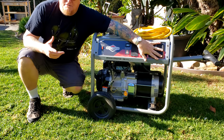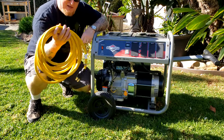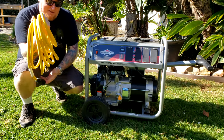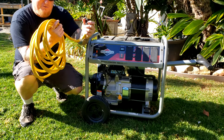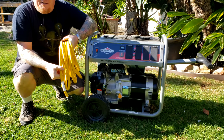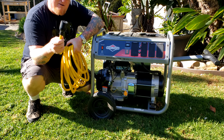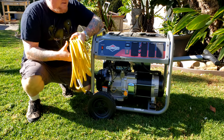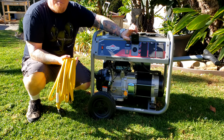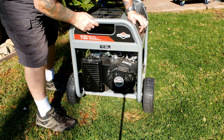They're all protected. I ordered one of these off Amazon — a generator power cord that has the male twist lock on one end that plugs in here, and then with a handy little device for your house you plug in the other end. You can power up to six 115-volt 15-amp three-prong outlets with just that 30-amp connection. Let's start this bad boy. First thing you want to do is hit the engine switch.